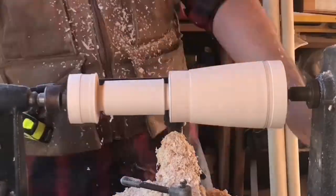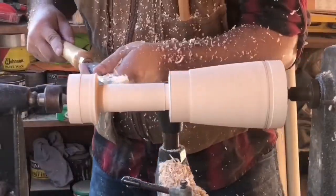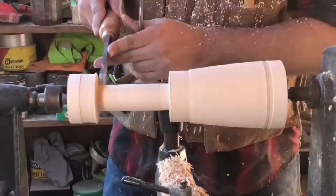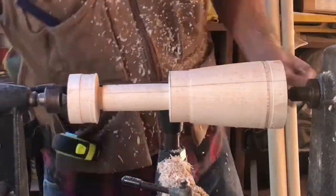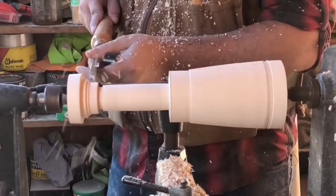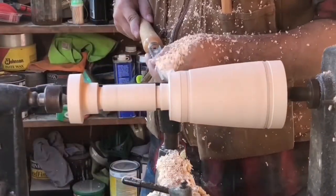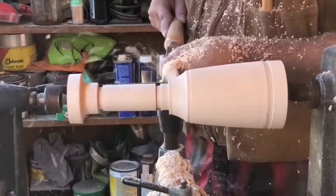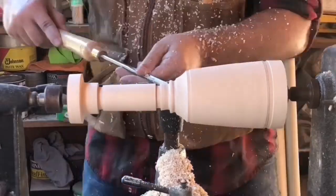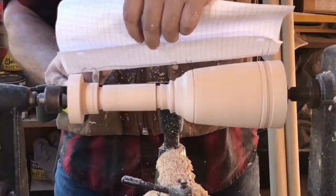Now I'm bringing everything down to the thickest part of the handle. I mark it on both ends, then use the spindle gouge and the skew chisel to flatten it out. Then I mark the thickest part as well as the thinnest part, and set my calipers to the two ends. Because I wanted a palm swell, I work on the pommel and get that to size. I found out from trial and error that for me, where my index finger and thumb meet, three-quarter inches is a comfortable diameter to have right there — a lot thicker than it was on my drawing.